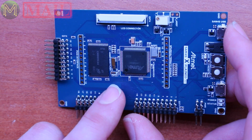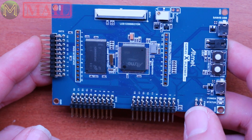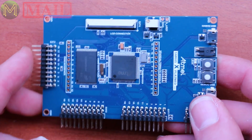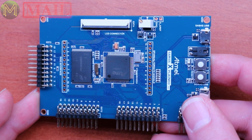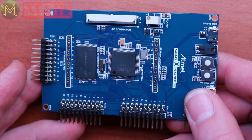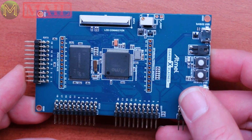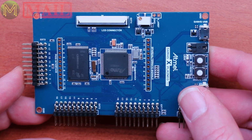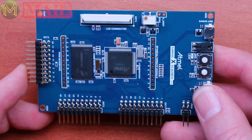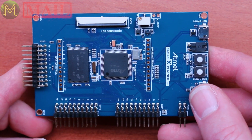It's a 120 megahertz Cortex-M4, has onboard 2 meg program flash, 160 kilobyte RAM. It also has an FPU, so it has some fairly primitive DSP functions. Supports also SD and eMMC, which is nice. Runs off 3.3 volt logic, of course. Has the usual complement of SPI, I2C, USB 2.0 host and device mode. 22 DMA channels, 15 ADC channels at up to 1 mega sample, so it's fairly speedy.